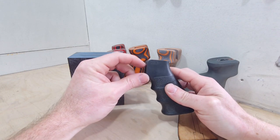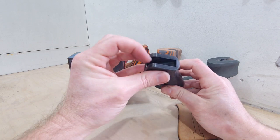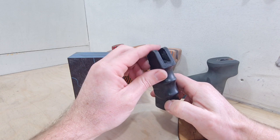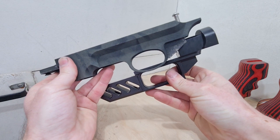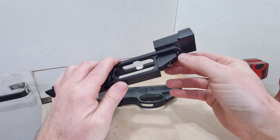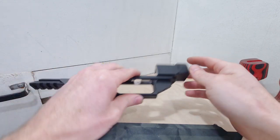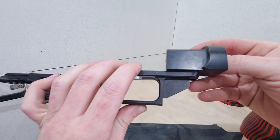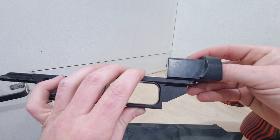The first thing I like to do is the round-over — this is actually a quarter-inch radius. A lot of European-made air guns have metric fixing bolts, but the actual width of the slot is in most cases metric, compared to like a three-eighths equivalent for an American AR. It's worth double-checking what you've got. This is a lower off of an Air Arms S510 Tactical and that's the lower off of an FX DreamTac. The actual length of this piece varies between the two — the AR sizing is much closer to the Air Arms version. So that's a quarter-inch radius in there; the easiest way is to do it on the router table with a cutter of the correct radius, though you could draw around a half-inch diameter rod, take it off on a sander, or file it. Best not to overthink it — whatever tools you've got to hand.